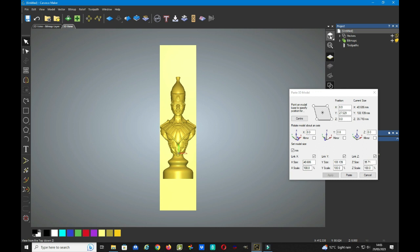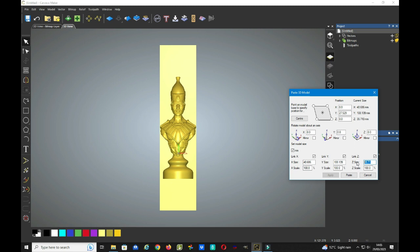And we'll just have a quick look by using the view button, and we can see it's in the center. Now we need to resize our model, so I'm going to resize the Z height first, and I want it in a whole number, which makes it easily divisible by 2, because we're going to drop the model halfway through our workspace. So we click apply,